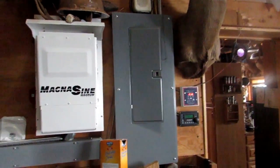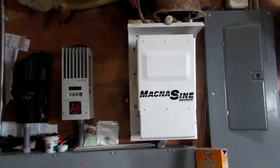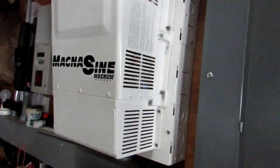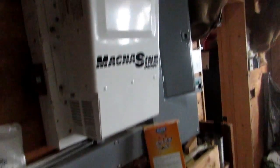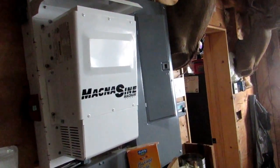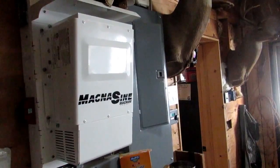We have a small house — maybe 1,000 square feet — but we can run just about any electrical appliance with our setup. We choose to have a very conservative consumption philosophy, because for us that's life off the grid. One of the main components here is the Magnum Sine Inverter — you're going to need an inverter and it's going to be big usually. What we have is an MS4024. It is sine wave, which means you can run electronics, TVs, all that good stuff. Nowadays everybody's got computers, cell phones, all this digital equipment — you need a sine wave inverter.